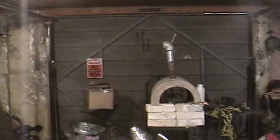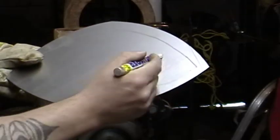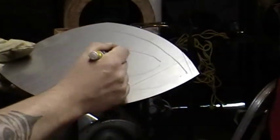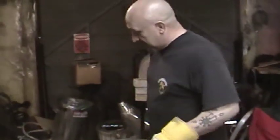Now what we're going to do is course. By coursing, what I mean is — contrary to what you would normally think — we're going to start on the outside. We're going to run along the outside with our first set of blows, then we're going to go to the inside, then we're going to finish on the center. I find this is a much, much easier way to dish and it goes a lot faster.